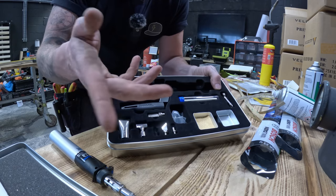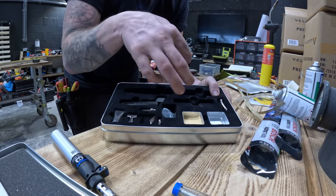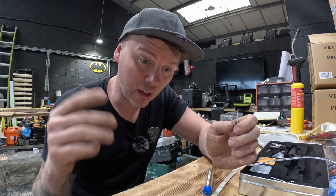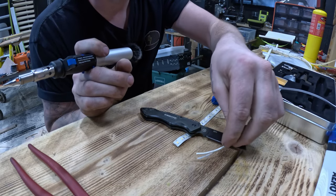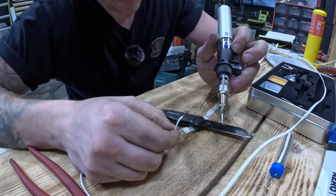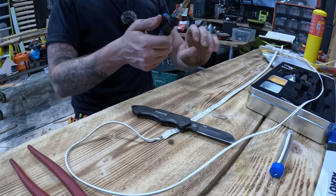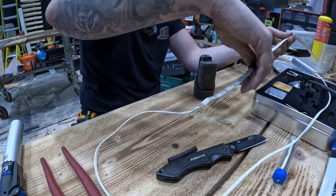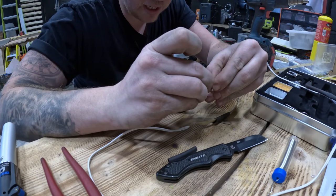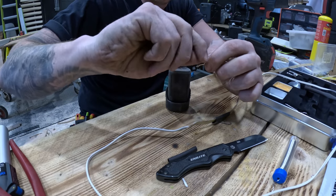So that's very cool — it comes with a cutting edge, bits and bobs, a sleeve, and you can fill that up with water so you can clean the ends off, so we'll just put a little bit of water in that now. Just stripped a bit of our wire, twizzled it around, snipped it off, so we want to tin these up first. What I've done on here is just scraped off the bits and bobs. I've got a 12 volt battery here — I used an 18 volt battery ages ago in a video and I actively realised when people said in the comment section it should have been 12 volt. So I've got a 12 volt battery and I'm just going to double check my connection before we start heat shrinking it up.